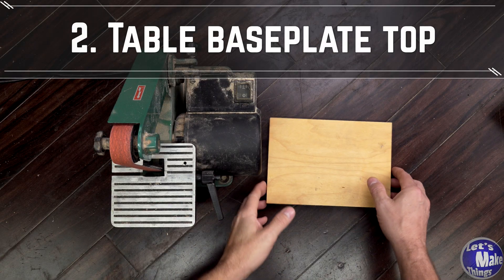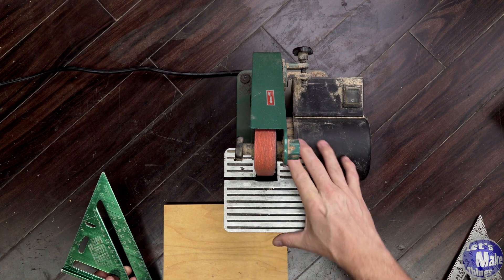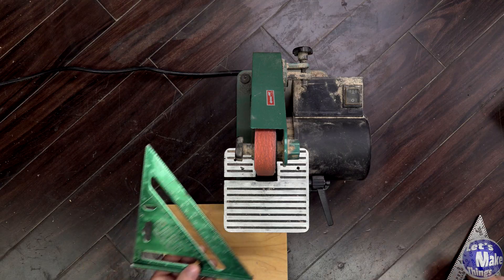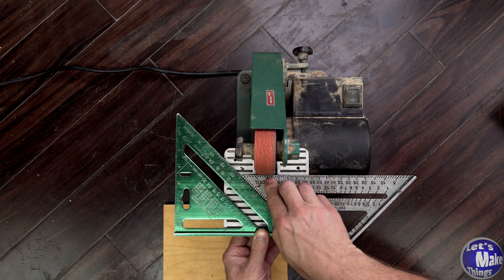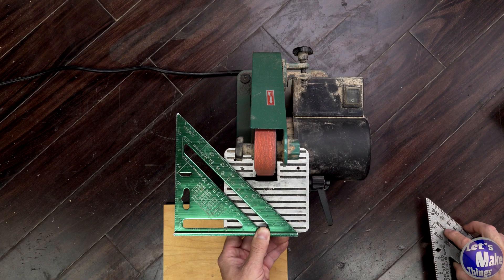The first thing we're going to do is build a base plate that will fit on the top of our strip sander. I'm just going to take the base off of mine and attach it to the bottom, but I want to make sure that this edge lines up parallel with this edge. I kind of figured it out with a couple speed squares — line this one up against the front and just check to see if I'm flush, and I am. So it looks good. I'll go ahead and take this off.